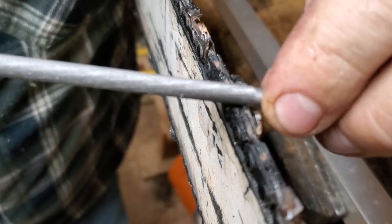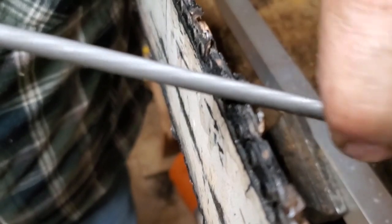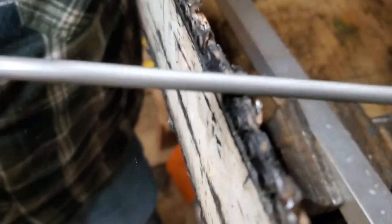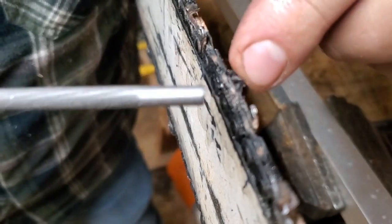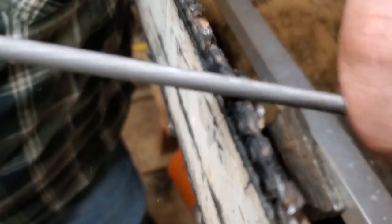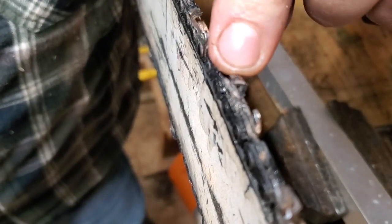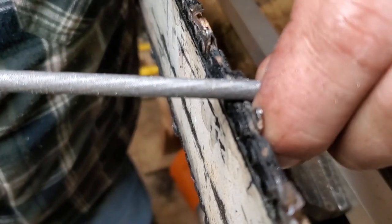What I'm going to do is start by getting the gullet — Buck and Billy Ray taught me this. It's that little C-shape in the cheek plate of the tooth that you want to get for throwing sawdust out. Mind you, these teeth are sitting at 10 degrees versus your standard teeth that are 25 to 30 degrees. This is for ripping slabs.